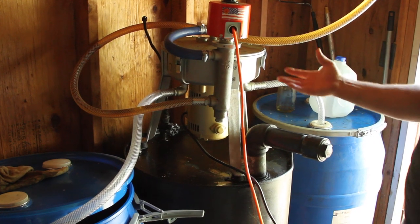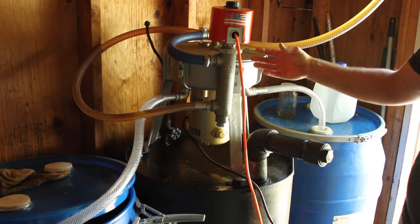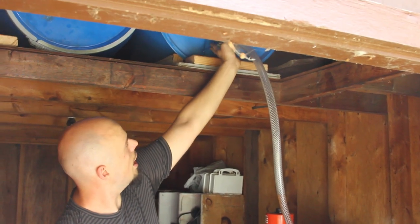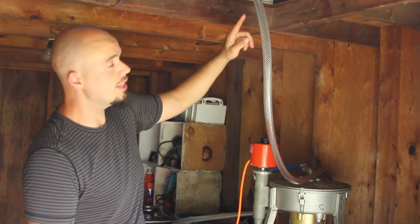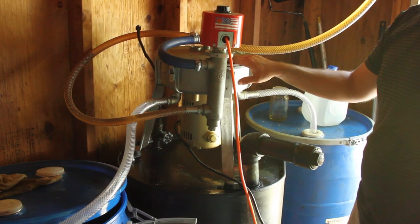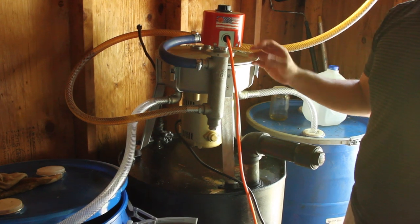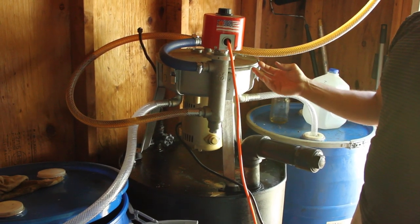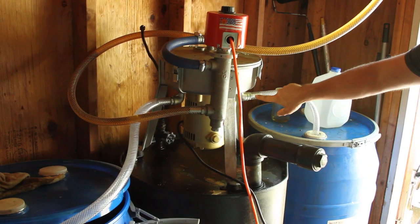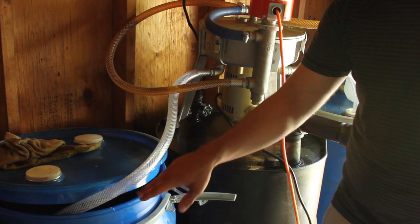Now we're in the shed and we're going to talk about our centrifuge, which is the heart of our filtration system. The centrifuge allows us to turn recycled waste oil from a restaurant into fuel quality oil. There's a barrel up here — we open the valve and the vegetable oil feeds down with gravity through here, comes into the bolt-on heater available from WVO Designs, and then goes into their Raw Power centrifuge. The centrifuge spins the oil at such high rates that it separates particles and water from the oil, leaving you with a pure fuel-quality oil. The clean oil comes out here into our clean barrel, and when you're done and turn it off, the waste oil empties into the dirty barrel.